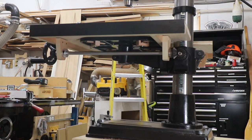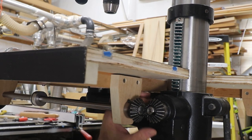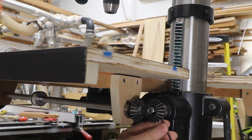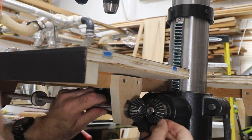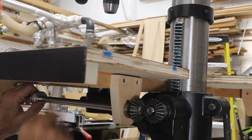All right, now we'll take care of the gears. Now, if I can keep this in focus while I do this, because I'm going to get in and out of the camera. So I'm lined up with this flat here, and I'm going to tighten that one down a little bit. I mean, these can be adjusted in and out a little bit if the mesh isn't quite right. And I marked the end of the shaft where the flat is, which is right where it is now.